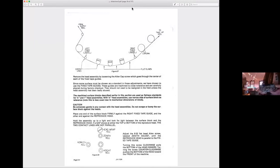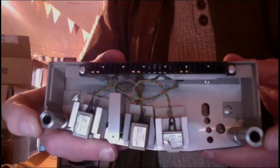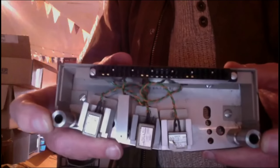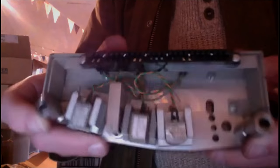Here's the backside of an MCI head block. These are the reference points for the head block — probably off of these posts. Similar to Sony. Is there only two for the MCI block? Yes, there is only two. APR 5000s have three. Three points is inherently more stable — the best way to define a plane is three points. I've always seen the similarities between the Sony APR 5000s and MCI designs.